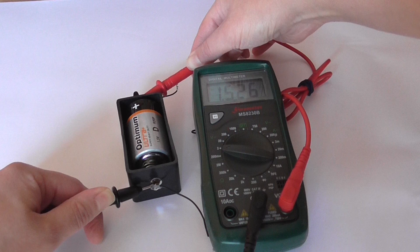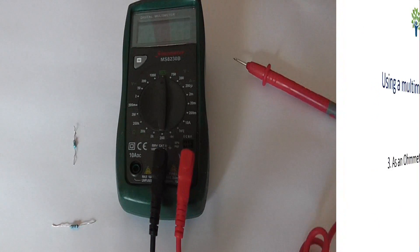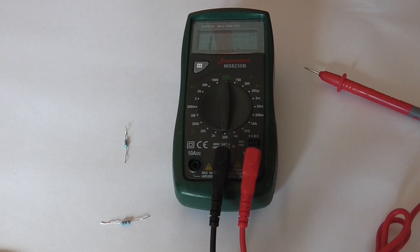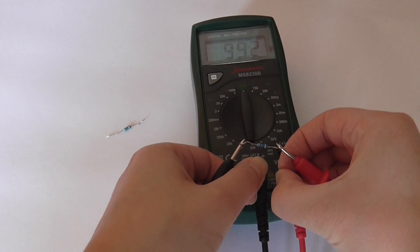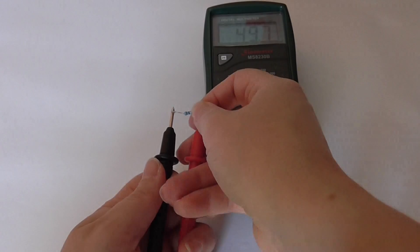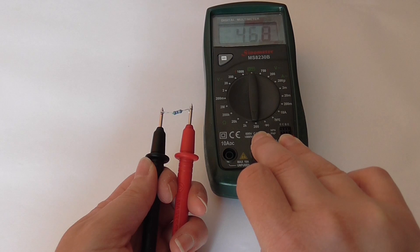In the next video, there will be more examples of using a voltmeter. We can also use this multimeter as an ohmmeter, which measures resistance. To use the ohmmeter function, we just need to pick a range – which is 200 ohms – and then put the terminals either side of the resistor. This reads 99.2 ohms, which is 0.8% less than the 100 ohms, which is within the stated tolerance. The other reads 46.8, which is also within the 1% tolerance.